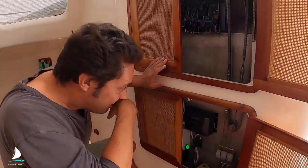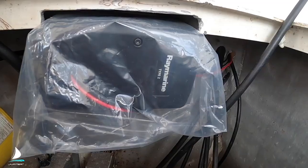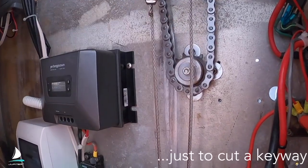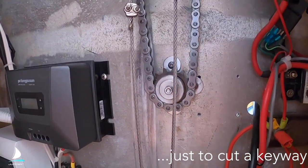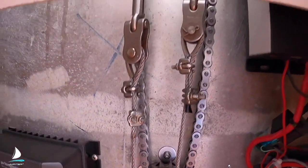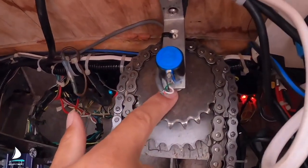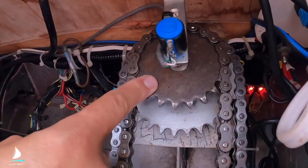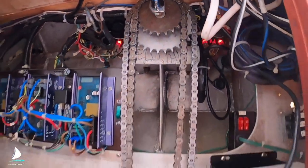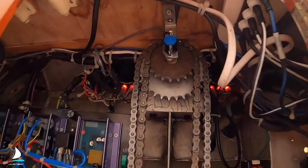Come have a look here. The motor is mounted on the other side of this bulkhead, and this is the drive cog that comes through. I had to get these cogs specially made here in South Africa, fairly cheaply. The drive train goes up to the steering - that's the steering axle just here, that's my normal drive cog for my steering, and that just pulls on cables that run to my tiller bar. And this is the new steering cog for the autopilot.